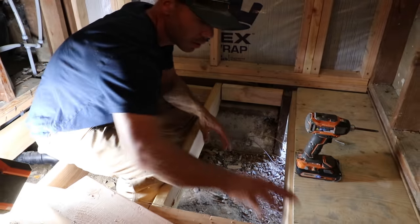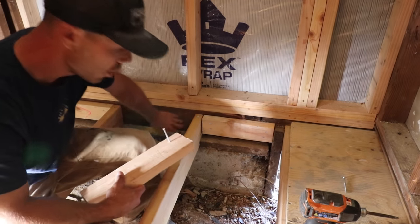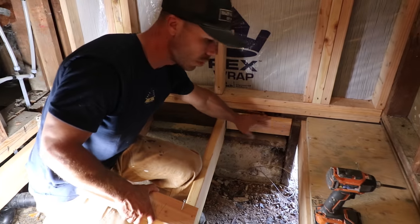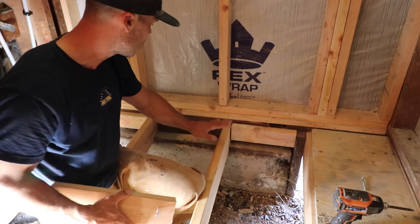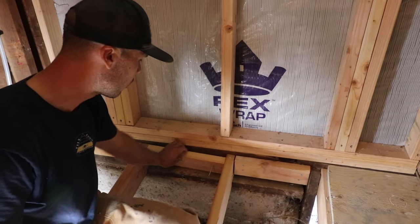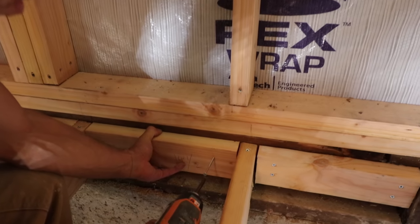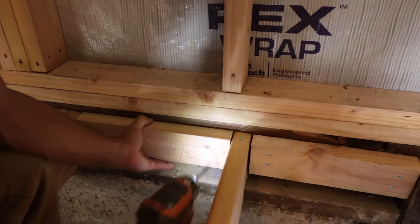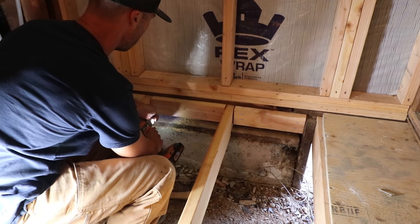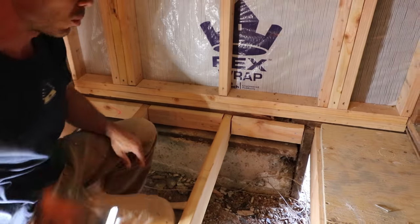What we did here is we got our 2x6 joists in. We notched them around the mud sill here. We got a rim joist and this is blocking. Even though we got 16 on center 2x6s here, it's always important to put blocking on the edges. A lot of people will run joists and then leave this open, and you don't get your perimeter nailing right on your plywood — the perimeter nailing is really important. So I made these nailers and I'm going to make them level with the top of the joists. Now we have support for the perimeter, and I do that around the whole edge.